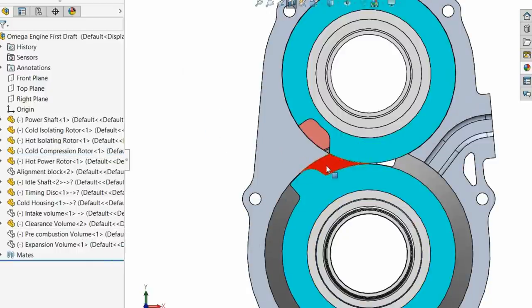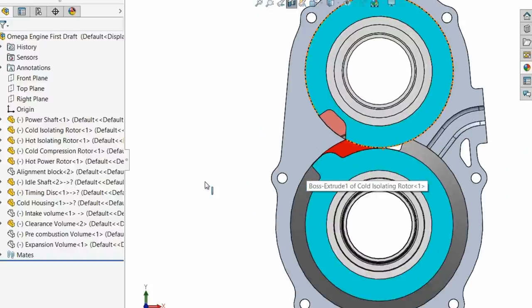So I've taken this volume here and looked at the swept volume, and the compression ratio is around about 15.8 to 1 to 14.5 to 1. The reason why there's a slight variance there is I'm just giving it a bit of leeway on the minimum and maximum of how I record this, and how you can change the timing ever so slightly based on the interaction between these rotors. Because I'm not designing things, I'm just looking at their model.